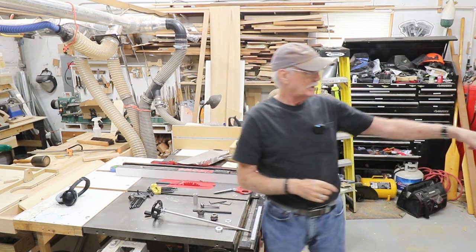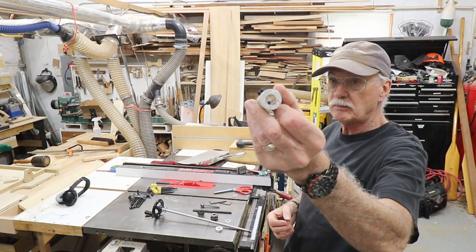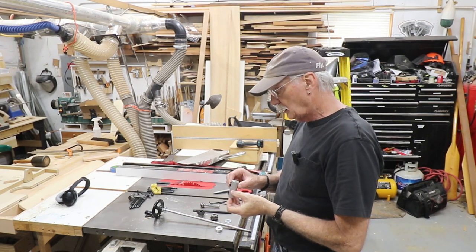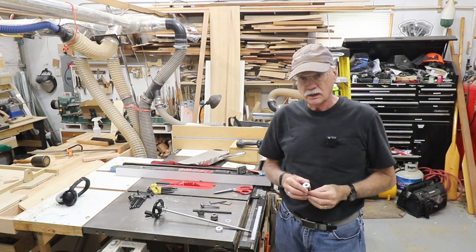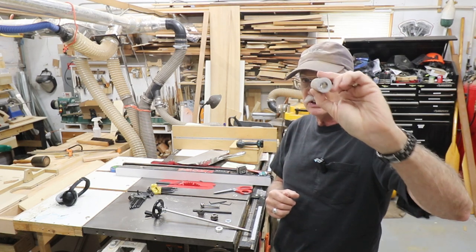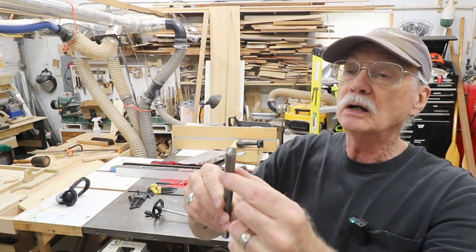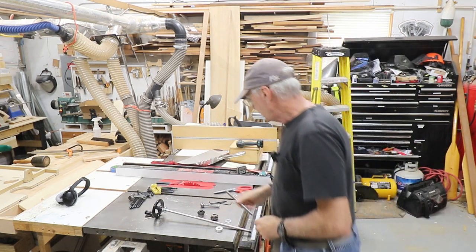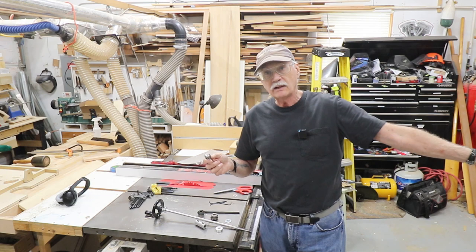Now, for the locking mechanism on the back, it's a little different. I have this McMaster-Carr aluminum thick wall tubing that is half inch ID, and this set 14 millimeter handle on the lock. So what I did was I just drilled this out 14 millimeters, left the half inch side the way it was, and cut off a piece of half inch steel rod to mount this to the crank handle. And on the end of that, since I'm using half inch stock, the old handle for the hand crank here wouldn't work.